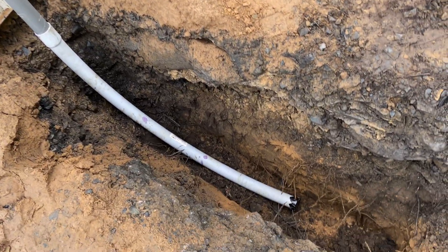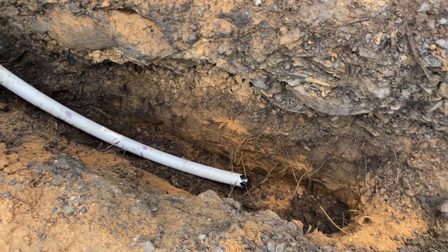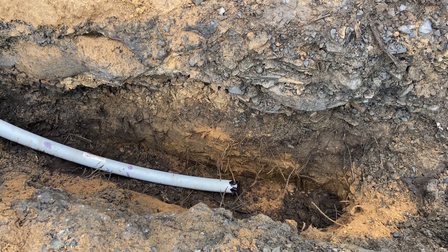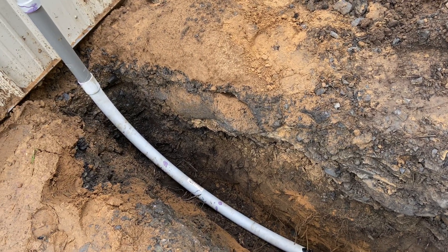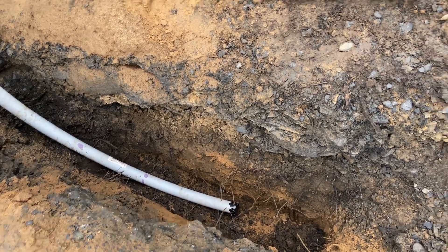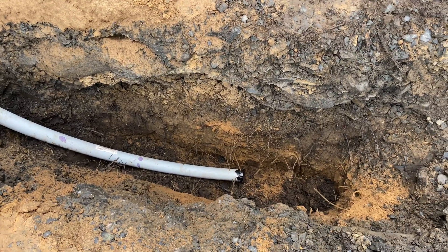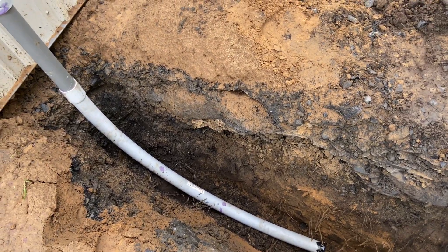What they require is for me to come out of the meter with a two-inch conduit, go down three feet, and use a long sweep 90, basically terminating right there. They'll either hook up with their own conduit or shove direct-bury wires in. That trench was hand-dug down three feet through two feet of shale — really fun, but we got it done.